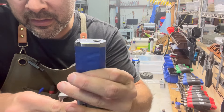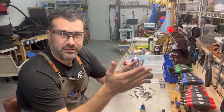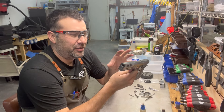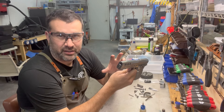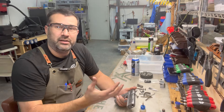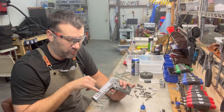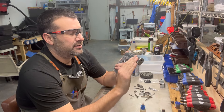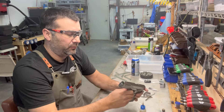The styling for this gun is a little different when planning a Damascus build because you don't want to hide the steel and all those pretty lines. You don't want to overdo it with checkering, diamond serrations, and the like — they can distract away from the Damascus. Most Damascus guns are pretty plain as far as slide serrations and cuts go, because everyone wants to make that Damascus pop. This is the first Damascus gun I've done with quarter-inch holes going all the way through to show the barrel. We're going to do a high polish on the sides and a yellow gold or rose gold high polish on the barrel, so it'll really jump through those holes.